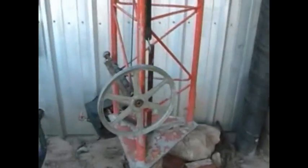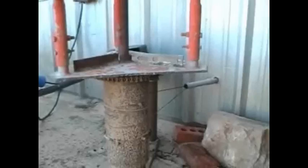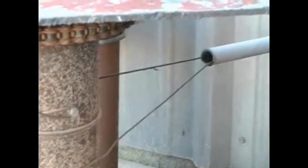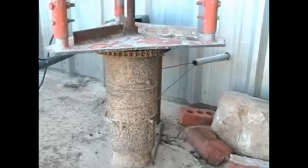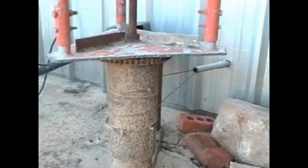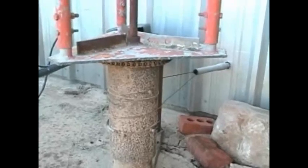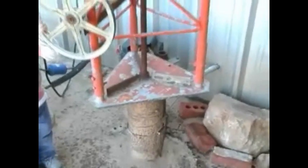Can you explain what the cable and the pipe going to the building are for? If you see back here on the back side — it's kind of hard to see — there's about an eighth-inch cable. This is a mechanical linkage cable that goes to the rotor control indicator on the map inside the shack. It's 100% mechanical, no electrical parts whatsoever. It's all mechanical cable and moving parts that rotates the dial on the map. It is extremely accurate and easy to calibrate if it gets off, but very, very reliable.